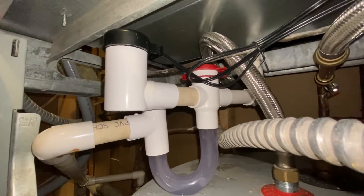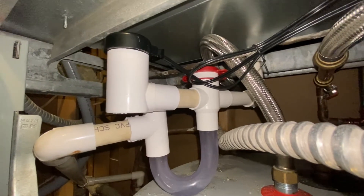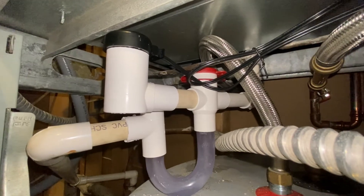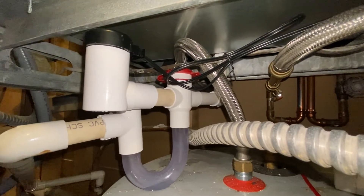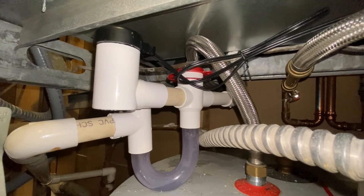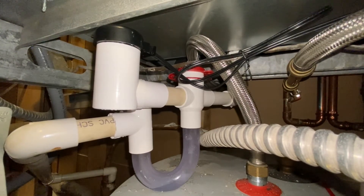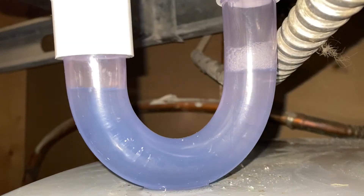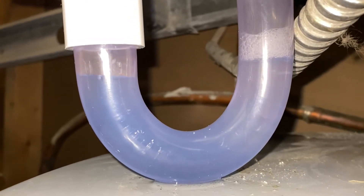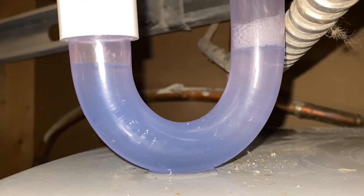I had a few problems with the cutoff switch. It turns out that the wires cannot just be wired however you want into the yellow circuit — you have to do it in a certain order. Unfortunately the wires aren't labeled, so I can't tell you that the black goes to the thermostat side and the white goes to the air handler side or vice versa. You just have to try one, and if that doesn't work, try the other. The P-trap is almost filled up, and as you can see there's a little bit of a difference between the water levels on either side — that's because of the static pressure difference.